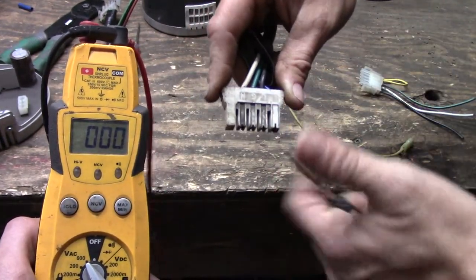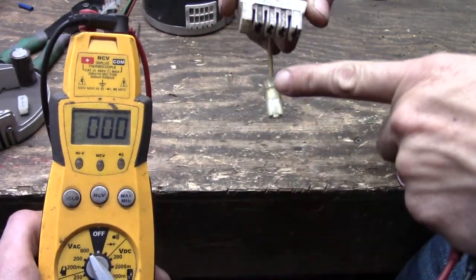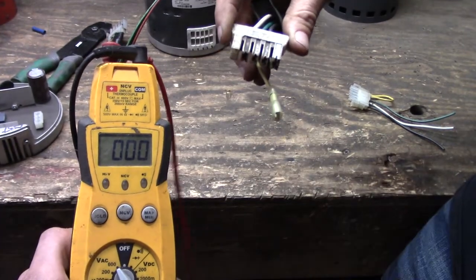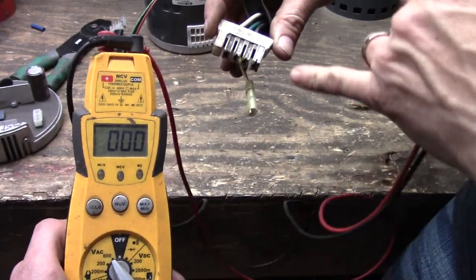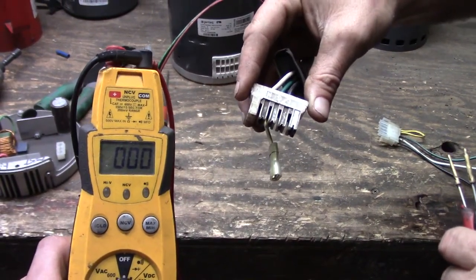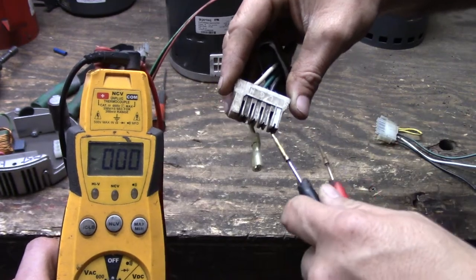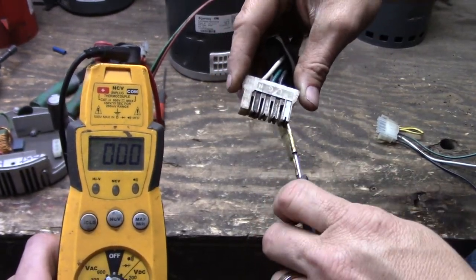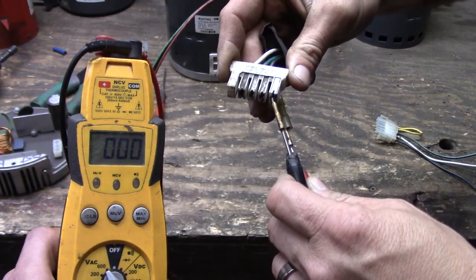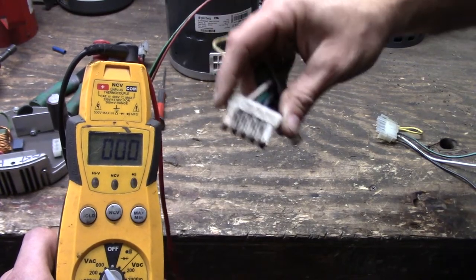The last one is C, and this has nothing to do with power going into the motor — this has to do with communications. You have a wire plugged into the bottom of your module, probably two of them, maybe a blue one and a white one, and it plugs into the bottom port one through five. When you're testing to see if there's power here, if you're in cool mode and demanding cool out of your system, the blower motor should turn on. To test if you have power, you test between the C and this wire, and you should get between about 14 and 30 volts. In this case we get 29, which is still fine. So that's how you test an X13 plug.